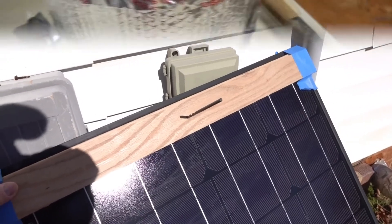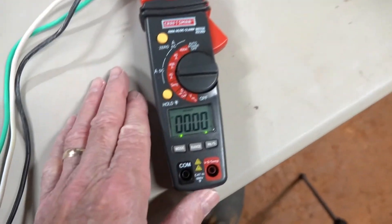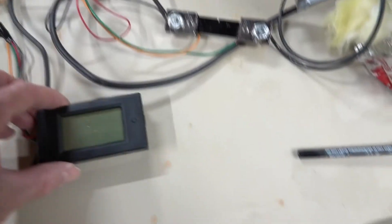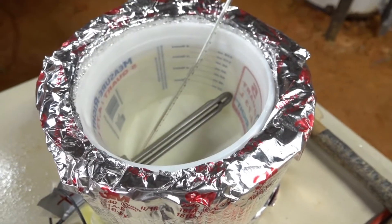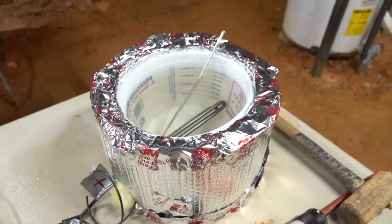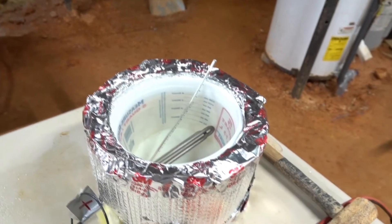So now I'm going to have to readjust it. When the sun comes up, we're going to measure the current with this clamp-on meter here. Right now it's not on — we don't have enough sun to give any current at the moment. I've also got this shunt-type meter purchased off Amazon; it comes from China. I've got 4,004.5 grams of water, weighed out on a top-loading balance, so I know exactly how much is in there. We'll see how the meters compare. We're going to wait for the sun to come up, then we'll get started.